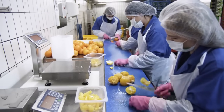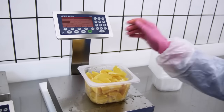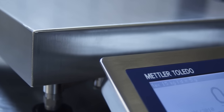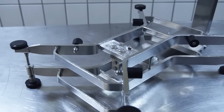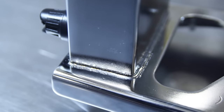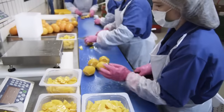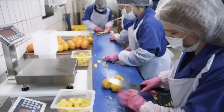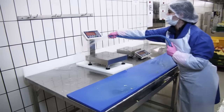The ICS scale family is built according to the latest hygienic design guidelines. Full 304 stainless steel, no corners, holes or crevices. Continuous welding and the double-sealed terminals make the scales ideal for hygienically sensitive areas, all to support fast, thorough cleaning and reduce risk of bacteria contamination.